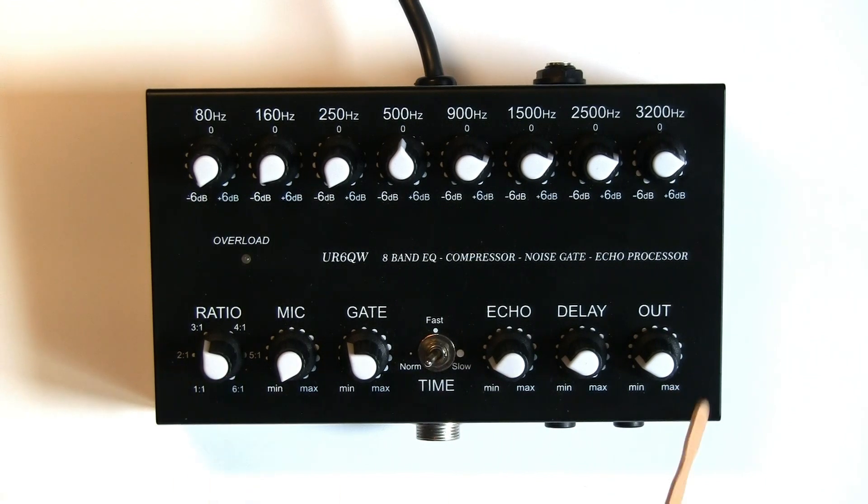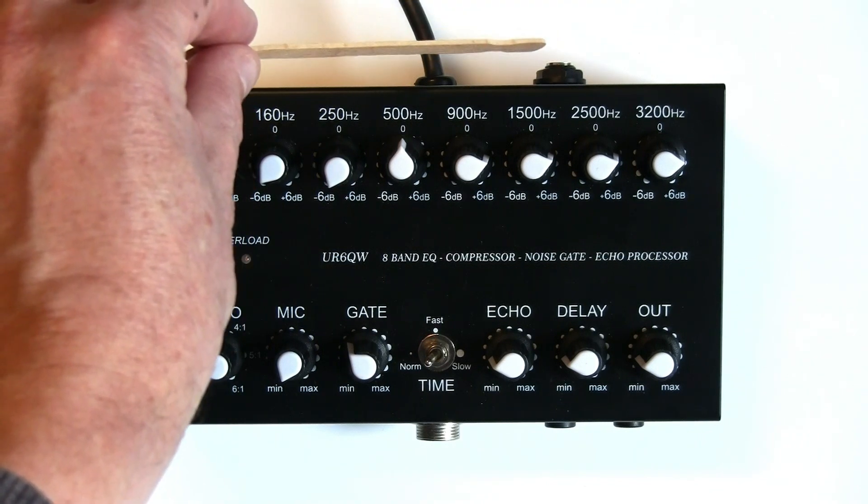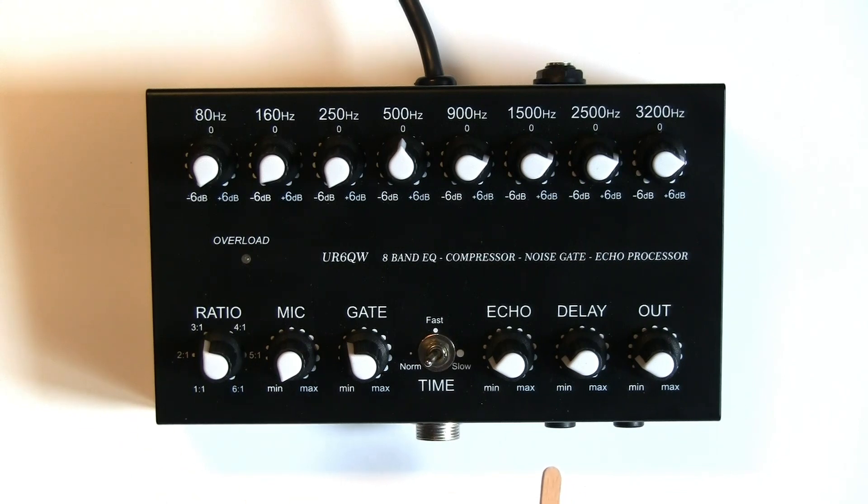We'll go through the connectors. There's a corresponding connector in the front for the stock microphone, so you can go stock microphone straight into the 7300. There's a PTT quarter-inch jack socket on the back — I've got a little hand button PTT, or you could put a foot switch in there. There is a microphone connector in the front in the form of a 3.5mm jack socket, and also a phone socket, also 3.5mm. It's nice in that it doesn't need any external power — in this configuration with the 7300 it's powered directly from the 7300. The socket in the front of the 7300 has an 8-volt output, and this runs internally at 5 volts through a linear converter.